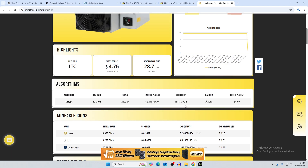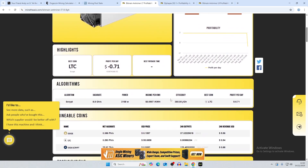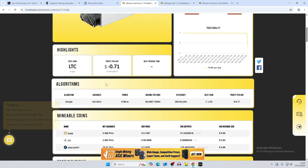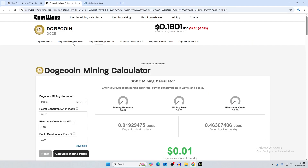The efficiency could be slightly skewed because it's one chip running on one board — we see that with BitAxes too, where efficiency can't quite reach the rated spec without underclocking. The last contender is the L7, but it would have to be very aggressively underclocked to hit those figures. Since the L9 has been out for a while and offers the best efficiency, I would assume they went with the L9 chipset.